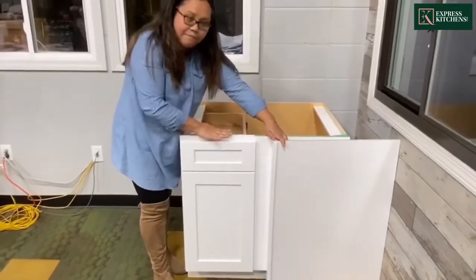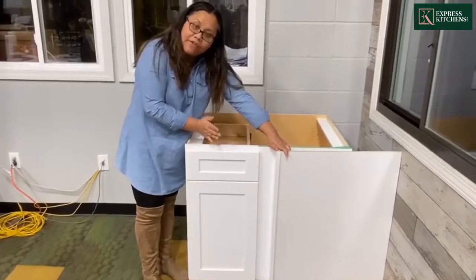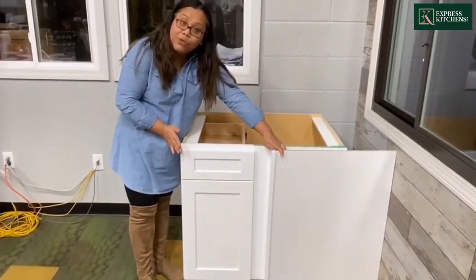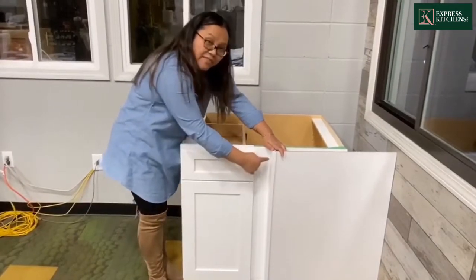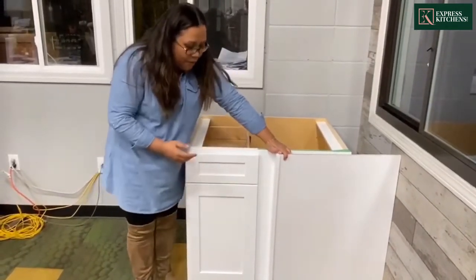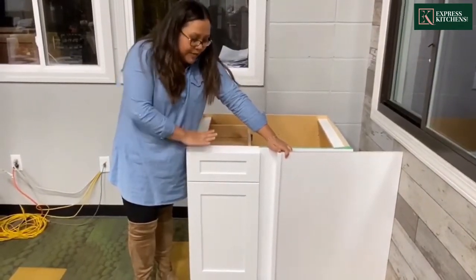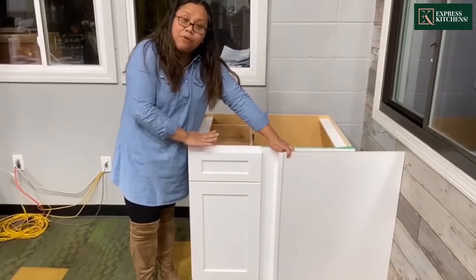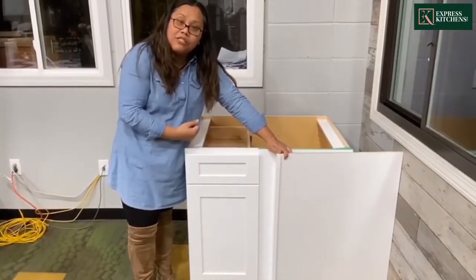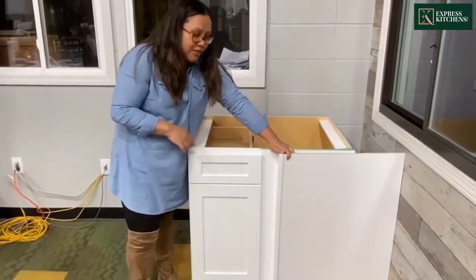So in this case, I pulled the cabinet 3 inches because I put it from this minimum set of 39 inches, pulled it 3 inches this way, so now I'm set at 42 to allow for this. So that's the importance of pulling. Now I'm gonna pull this 6 inches now. So for example, in this case, this is a 3942, I'm gonna pull this cabinet or over pull this cabinet to 6 inches, thus pulling it to 45 inches. I'll show you what that looks like.